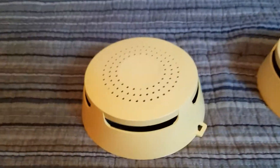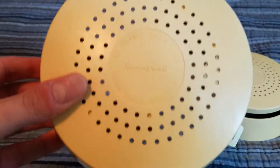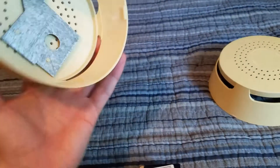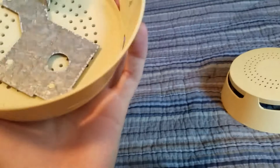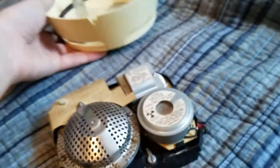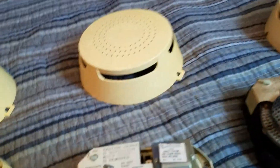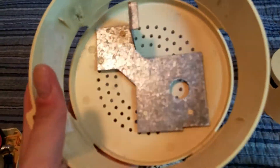Here are the covers - it's the regular design that Honeywell used for these, with the tapered design, four large side vents, three rows of round holes encircling a center badge that says 'Honeywell - to silence, remove cover.' Of course on the TC89B battery model that center part was a test button, but on these it's just a label. The interesting thing about these covers is they have a little tab on the side where the LED is, which I've seen before but very rarely. I've never seen a Honeywell TC89B that doesn't have that tab, but I've mostly seen the hardwired ones without it.